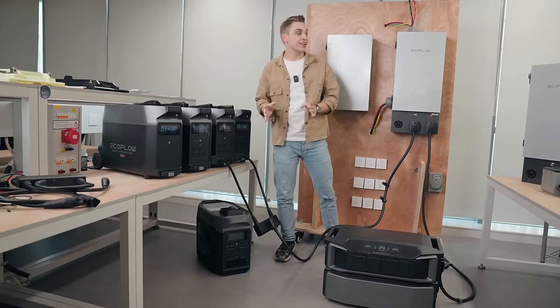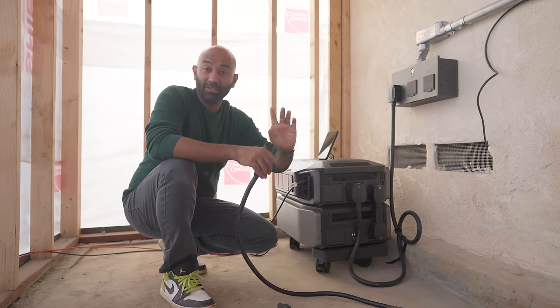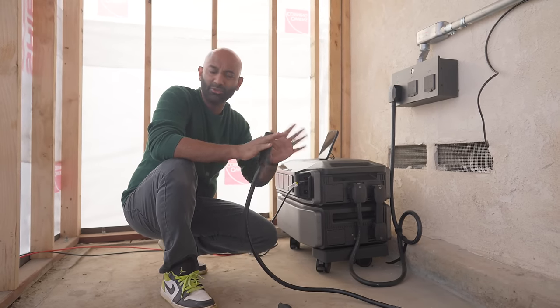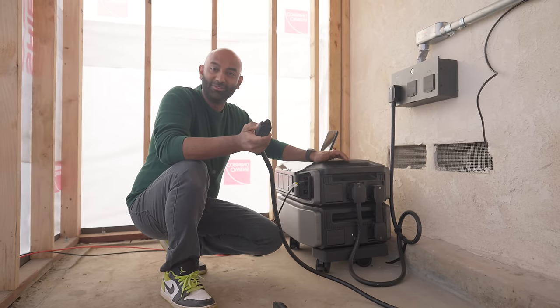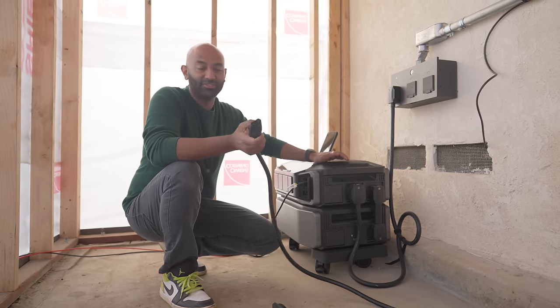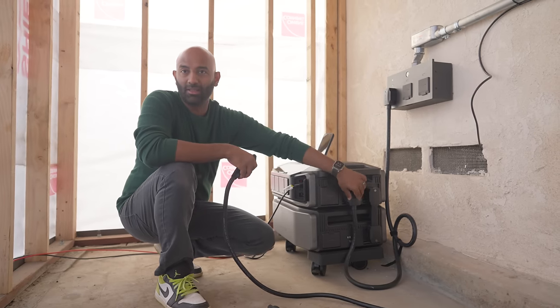So this cable is different now. So I'll talk to EcoFlow, and there's probably an adapter you have to get, but the Delta Pros will work with this system and we'll do that in episode 2. But that one is the reason why the cables are different. This has just the one line for 120, and this has both legs allowing you to have 240.